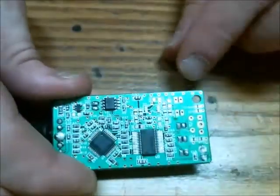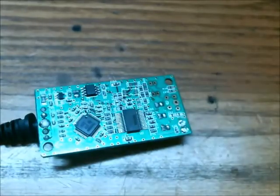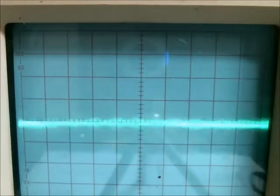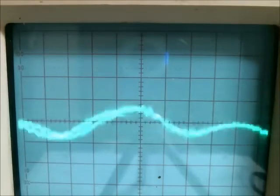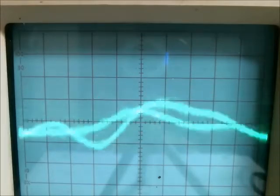I've removed the microphone, and now I want to determine what kind of microphone this is. I have a feeling it's one of the active types — or whatever you want to call it — that generates its own voltage. So I'm going to hook it onto my oscilloscope to see if it generates a voltage. As I speak, you can see my voice is creating its own voltage, because it's the type that is the inverse of a speaker — a membrane, a coil, and a permanent magnet — and it generates its own voltage.